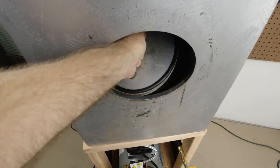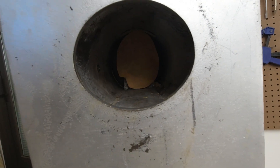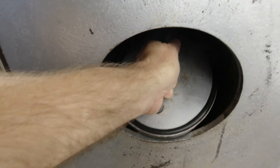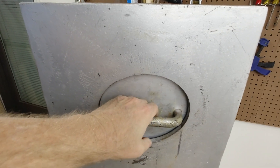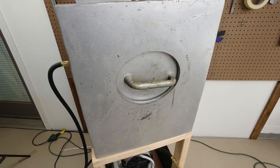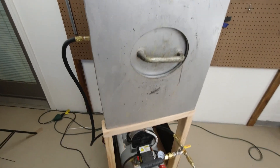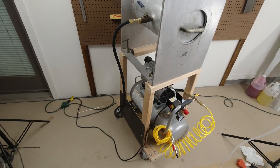The disadvantage to this design is you have to have a tank with pretty good capacity — it's pretty deep, the full length of the pipe — because your bolts have to fit in and you've got to be able to get the door in. You need room inside the tank to close it. That's the biggest disadvantage. The huge advantage is that you can cycle the parts in and out of the tank super fast. I'm really pleased with this cart and the design — it's worked out really well for me.